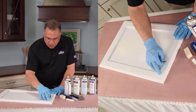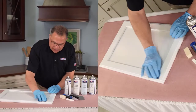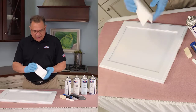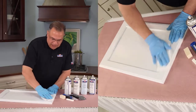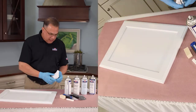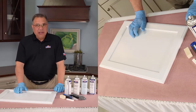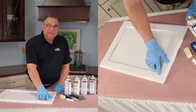We're going to sand that area with 1000 grit or 800 grit paper, and if I can get inside that dent I will. Some of you who have used hard fill before may say you don't normally sand before — but I'm telling you the absolute best way to do it is to sand first. You will come up with your own shortcuts, but I always do this to get really good adhesion between the hard fill stick and the surface of the finish.